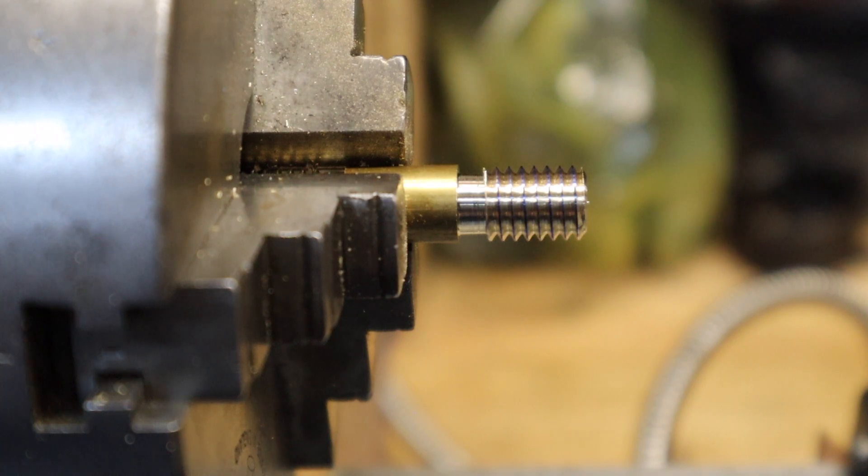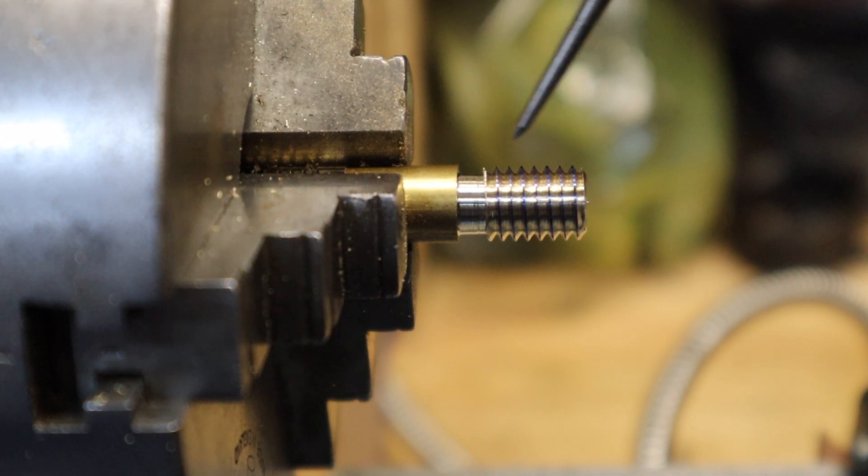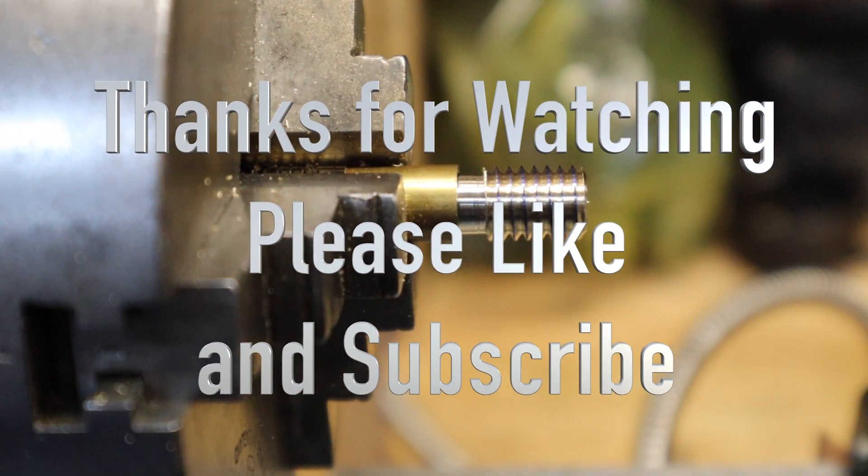I hope you enjoyed that — I'd be interested in your comments. I know there's more than one way to cut a thread; in fact there are loads of different techniques. I would actually prefer to cut threads backwards, but on this particular lathe the chuck is a screw-on chuck, so I can't cut threads backwards and upside down coming away from the chuck. On a deeper thread where there's any stress on the tool the likelihood is the chuck will start to unwind, which is going to throw your thread out and ruin it. So don't do it — but it's up to you.